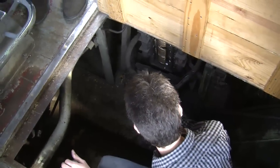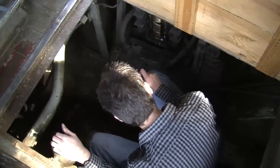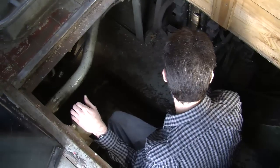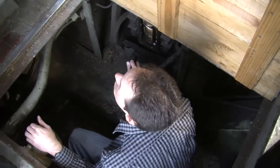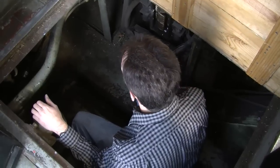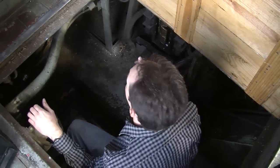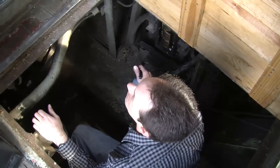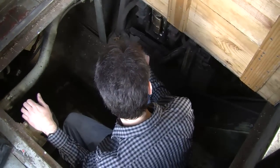Okay. Well, that is a gargantuan DC switch. And from the looks of it, I'm guessing it's two pole. I've never seen a switch that big in my life. That's amazing. So that is probably either on or off for the motors, or this is the switch that takes us into and out of transition, because the transition is when we go from having the motors connected in series to having the motors connected in parallel. And they don't label the switch in here that way, so I honestly don't know if you start in series or start in parallel. My guess is they would start in series and then transition over to parallel, and that would certainly be the kind of switch that I'd want to do that with.